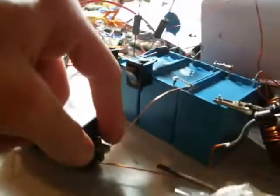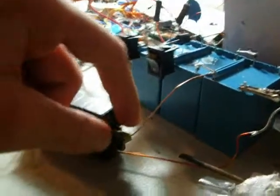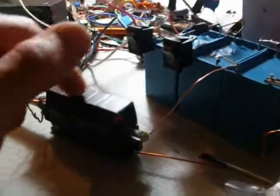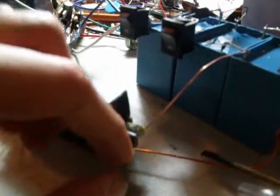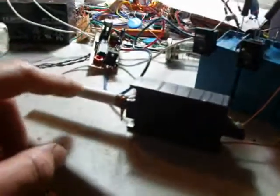The magnetic field of those two coils aligns in such a way that it penetrates the barrel vertically. And two rails inside the barrel — two electrodes — go in that direction. So the magnetic field penetrates the area between those rails. This gives acceleration to any ions travelling from one electrode to another towards this end.